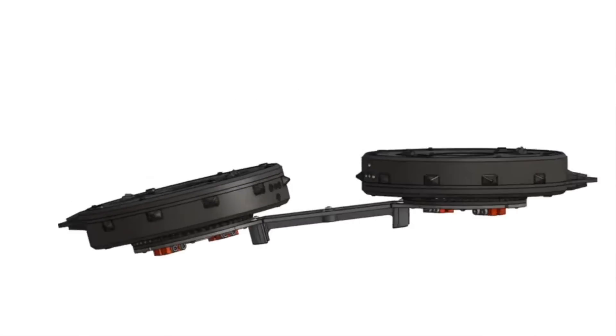This was an idea that as soon as I sketched it out on paper I knew I just had to do it. I wanted to be the first person to make it. The design consists of a walker-style robot like Droopy that uses gyroscopic forces to wobble across the arena, and I wanted to build each disk or bar as you would build a melty brain robot. A melty brain robot revolves around itself driving on the floor and can veer in a certain direction. I figured I'd make two of them, connect them by a bar they drive on, and control it that way to get a weight advantage and more weight into the spinning mass.